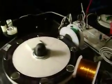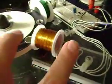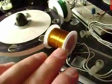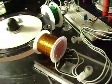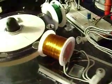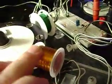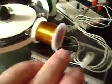Here's my new little setup. This is a new coil — it's not very big. I wound it by hand with 200 feet on each roll of 30 gauge wire, and then I wound another coil on top with some extra wire just to give me some variability. So we have three independent coils there.